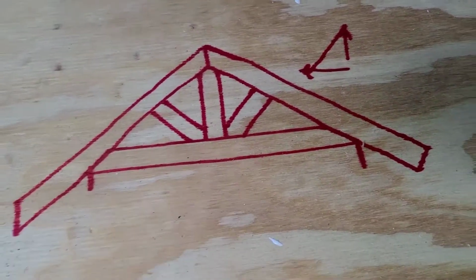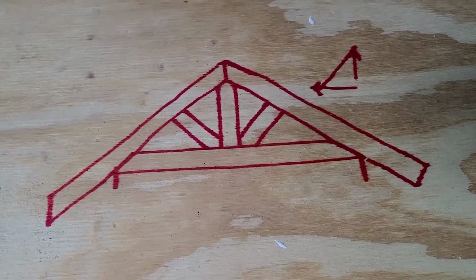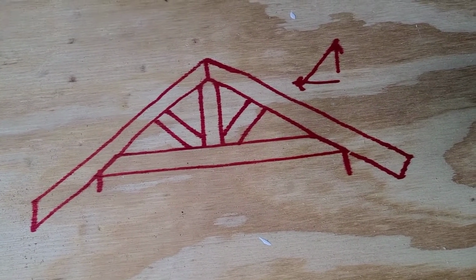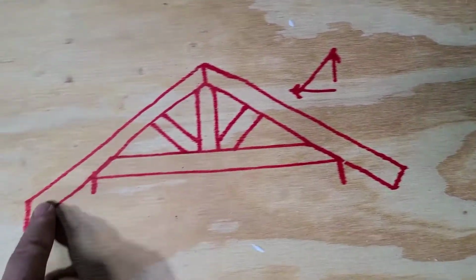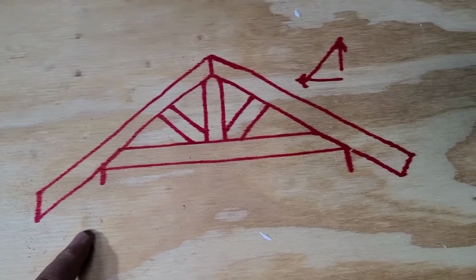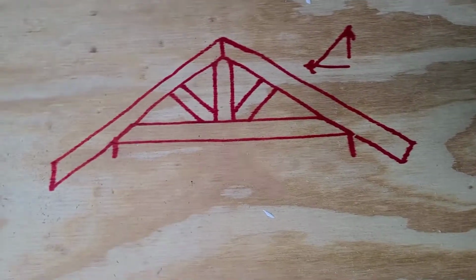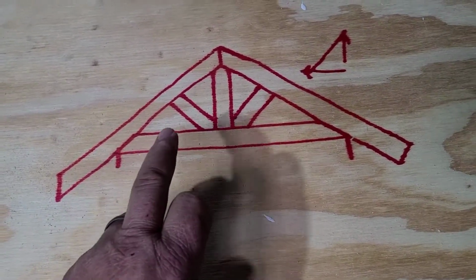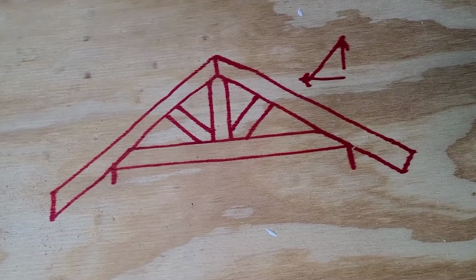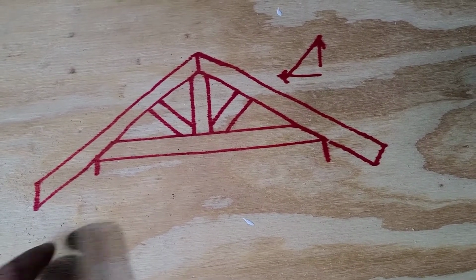So now, there's ways to figure out your rafter length. There's calculators online to figure that out. You give them the different dimensions and they'll tell you how long of rafter you want with your overhang included and all that. But you don't have to go to such great lengths to figure that out. Say, like for mine, we had right around a 6-foot rafter length. So a standard 8-foot 2x4 is what we used because they're cheaper. So I just took two 8-foot 2x4s.